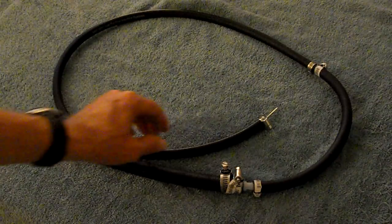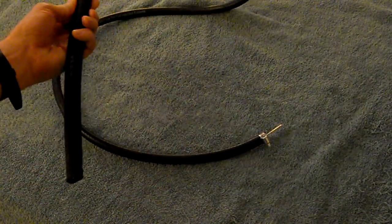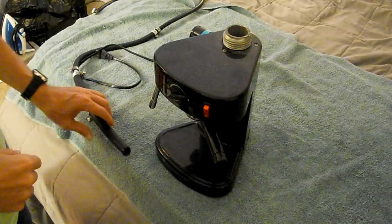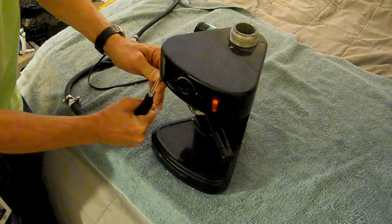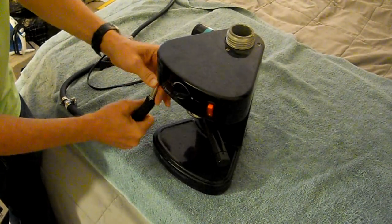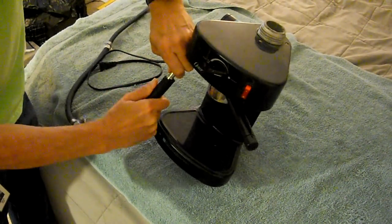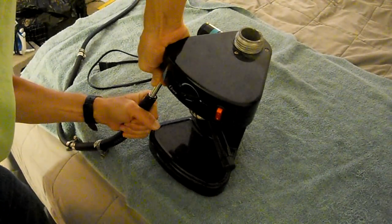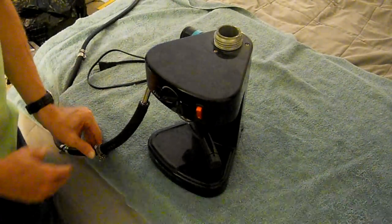Here's part of the steam machine I put together — this is a couple sizes of hose from the hardware store with a basketball inflator needle on one side. If those couplings came loose, that would be a painful experience. Here's the espresso machine — it allows me to adjust the amount of water and steam coming out, and that turns out to be a very good thing. Too much water can cause the finish to cloud, cause the pick guard to delaminate, or even cause braces to come loose. I'm attaching the hose and sliding up the circular clamps to make sure it has a tight seal.